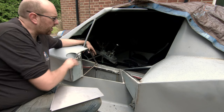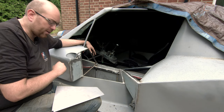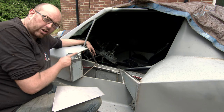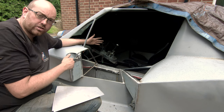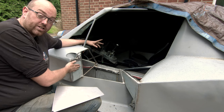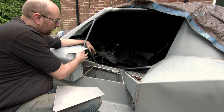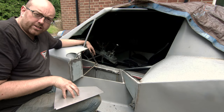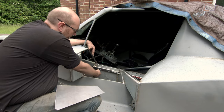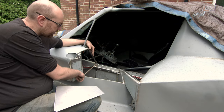It's been raining all day today and this is the first time I've been able to get the camera out, but I have got a little bit of work done. I managed to weld in that panel - I decided not to make a new one and waste a bigger piece of stock. That's now all welded in and I've got another piece cut to weld on the inside edge. To get the dimensions for this piece I had to finish off the spars, including moving the one that came horizontally parallel with the floor across onto the outside edge of this pod section.